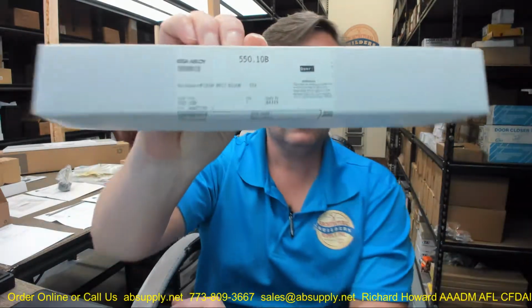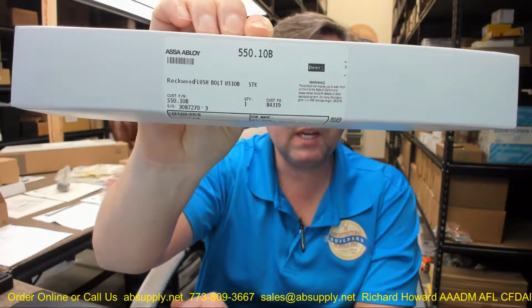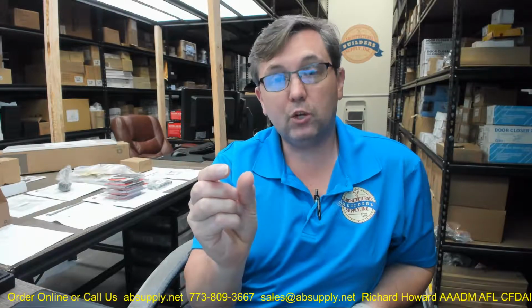In this video I want to bring you a closer look at the Rockwood number 550-10B or 613. This is a Rockwood flush bolt, the 550 flush bolt. If you've ever seen a Rockwood flush bolt, it's probably the 555. That's the 1-inch wide manual lever extension flush bolt, 6 3/4 tall, 1-inch wide. This is the 550.